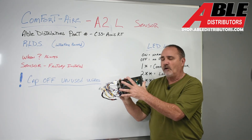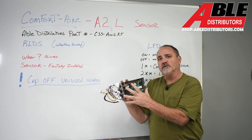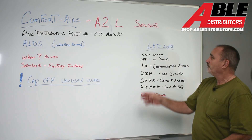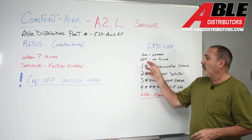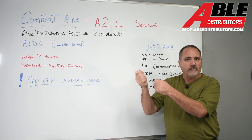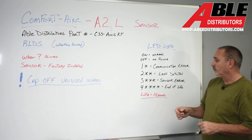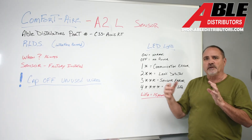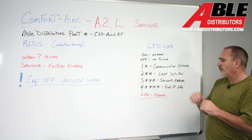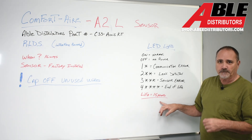Inside, the unit looks a little complicated, but the only times you'll open it are: first, to slip the sensor wire in and plug it into that white plug right there; and second, if there's a fault code, to see the flashing LED light. Steady on means normal operation with power. Off means no power. One flash is a communication error — the sensor may not be plugged in all the way. Two flashes means a leak was detected somewhere in that coil or plenum. Three flashes means an error reading the sensor — check all your connections. Four flashes means end of sensor life. Most manufacturers agree these sensors last about 15 years.